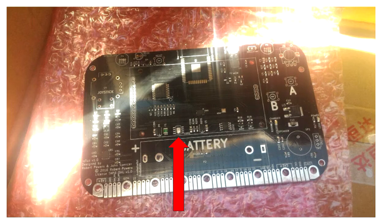There's a fuse there that I had specified, but I had let them do some BOM replacement. What that means is you basically say: this is the thing I'd want if you can get it, but if you can't, just put in whatever meets the same specifications. This can work if you're careful, and usually does for simple components. But unfortunately for this fuse, it did not work — we got something that was really screwing up the battery circuitry. So the lesson there is you've got to control what you can.